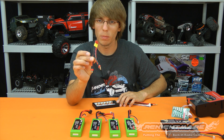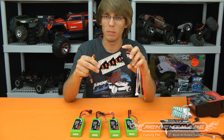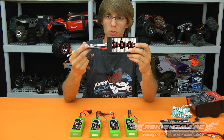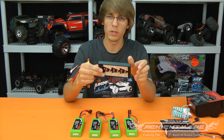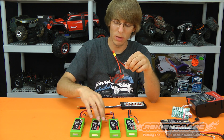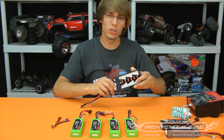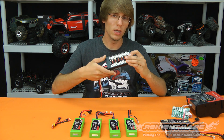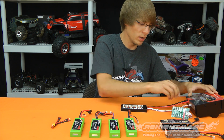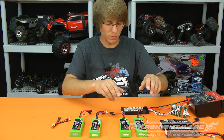This product I'd like to show is a nice parallel charging board. Instead of making all these individual connectors, this one board can do six packs at a time. It's called the Para Board — I got it from epbuddy.com. It has all the balance connectors on the sides and Deans connectors preset on the board. There's no chance of screwing up the wiring because it's built into the PCB. I've got the Power Lab 8 here — I'll plug it right in. The setup and wiring is super simple.